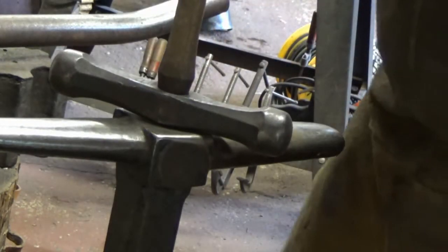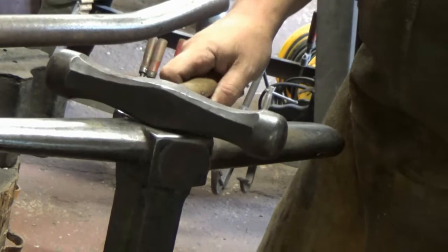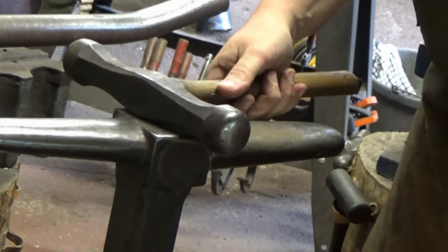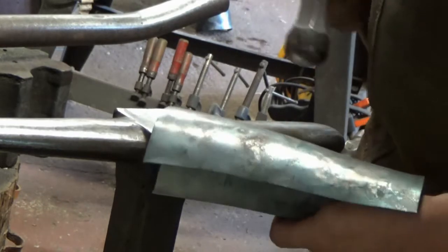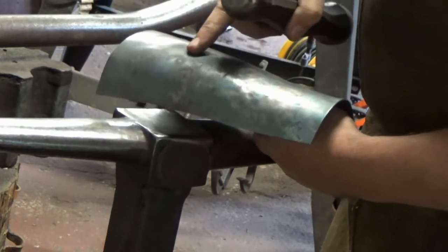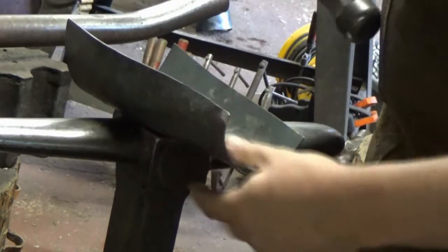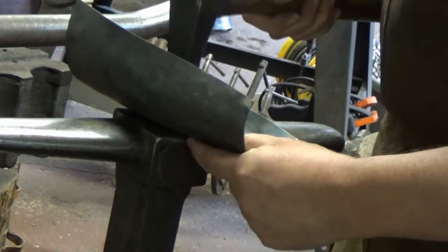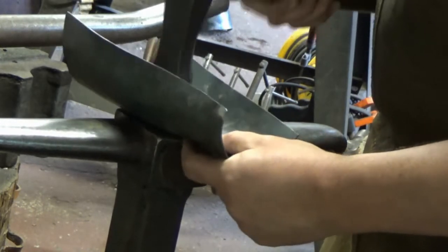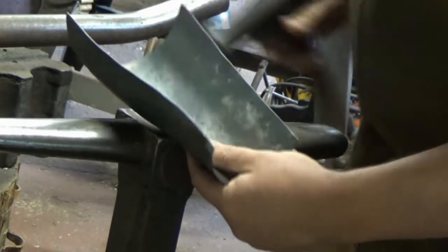A very fortunate acquisition some years back is this old hammer from 1918 — it's got a date stamp on the underside. I've no idea of its original purpose, but it's fantastic for planishing curves from the inside out. I do an awful lot of my planishing from the inside out — I just find it easier and it makes for a much smoother surface on the outside. I have a small depression here that I need to lift out of the material, so I put it in my stake with that slight reverse dome and just tap it through from behind.